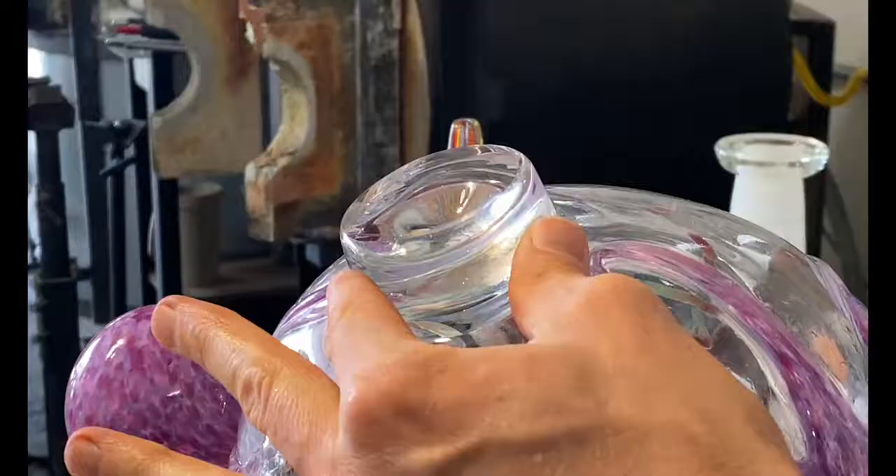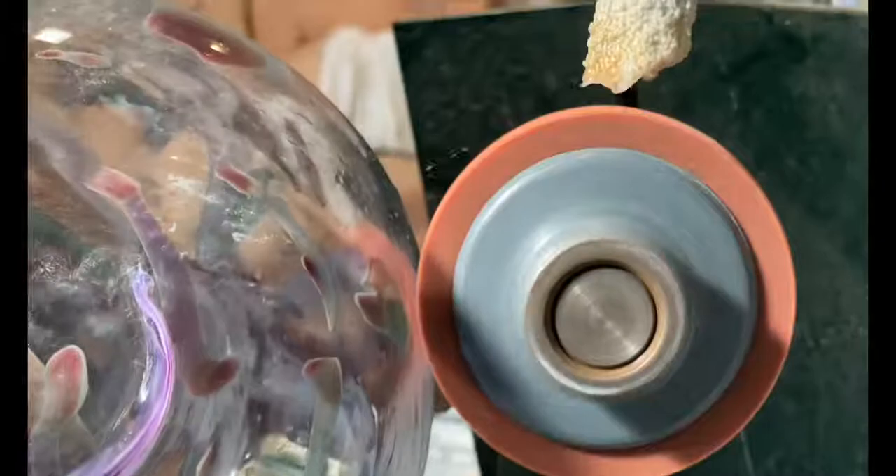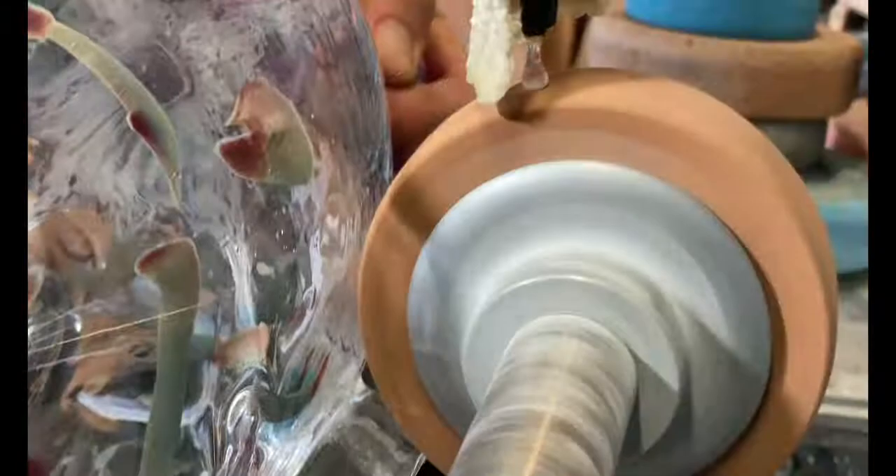There's the final polish — the cerium really cleans up the glass and takes it back to that quality crystal look. I had a little accident when I was working on this piece, so I'm going to show you how to fix that. First I'm going to take it to this orange poplar wheel and rough out the scratch, then take it to the blue wheel, and the final wheel is the brown one. I can still see a little bit of scratch in there, so I put a mark on it with a permanent marker so I can see where to go. Now I think I got it all.